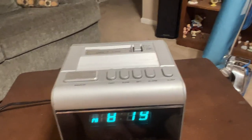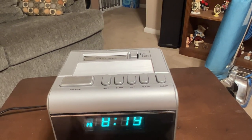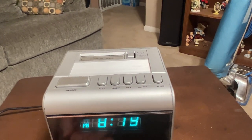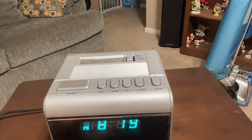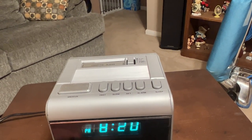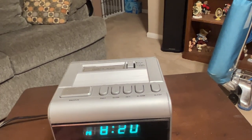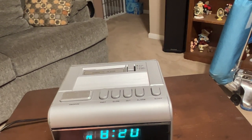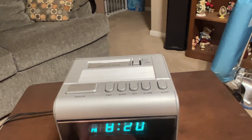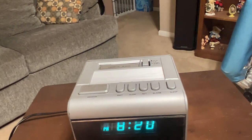Now, the tape transport in this is a Tanashin, and it's not quite like the later models. Like this is from 1983, and yes, it would be considered cheap in 1983 because it does not even have a supply spool spindle at all, so it just pretty much freewheels in the air. You gotta remember, for 1983 standards, what was considered cheap then is actually built far better than anything you could buy today. The mechanism has pretty thick gauge steel construction.